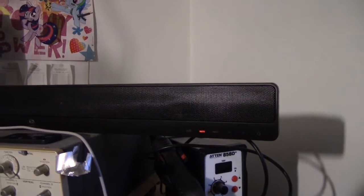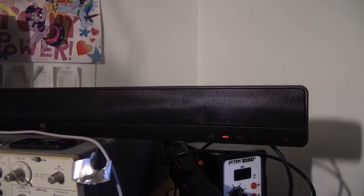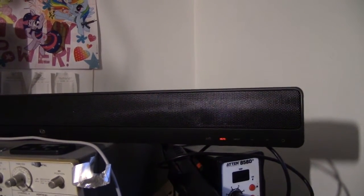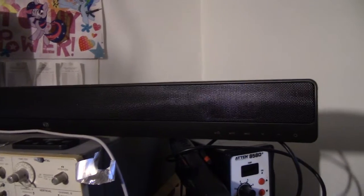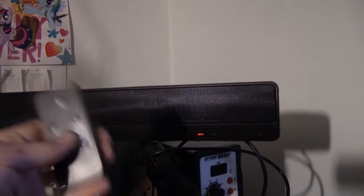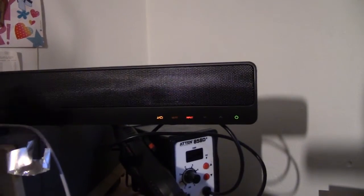So there's really nothing else that could be wrong there. As for the resistor, it works, since shorting the button side of it to ground disables the button. So I could replace the chip, but I'm not going to, because I've got the cute little cheapo remote that belongs to this unit, so I can still switch sources however much I want by just using the remote.